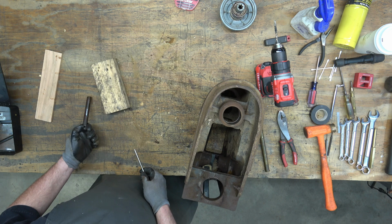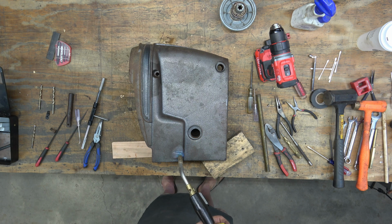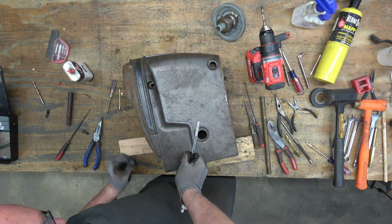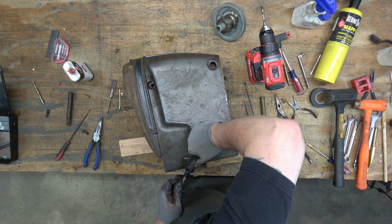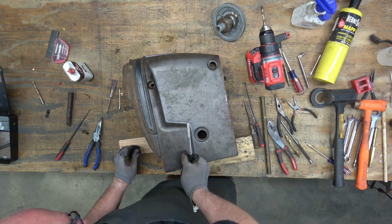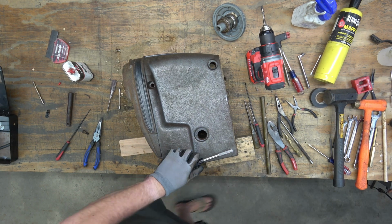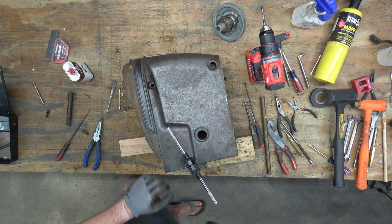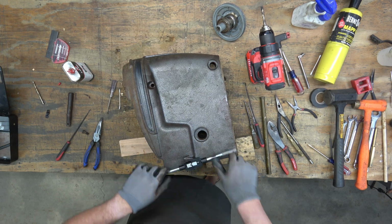And it actually, I didn't even drill into it. It's got some markings on there where the screw was hitting it, but I didn't drill into it. So we've still got a lot of material on the threads from the original screw. So we're going to heat all that up. And then we're going to run a tap. Same 5/16 by 18 thread tap all the way down in there. And that should force all the material that's stuck in the threads out of there and out the bottom and into the opening that that rod was sitting in. And if this works, then we didn't have to retap anything. We're just cleaning the existing threads.